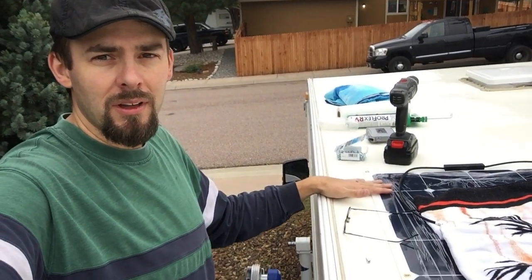Now that it's finally not raining — it's been raining for days — I finally decided to put the solar panels on the roof. I've cleaned the roof extensively: soaked it down, cleaned it off, used some mineral spirits to clean it up really well, then rinsed that off and soaked it down one more time. I've already got one panel up here covered with a towel so it doesn't generate any electricity, because I've got to splice the wires together. I've got two of these to go on the roof and may add a third. They're nice and lightweight — they're the flexible solar panels. They've got a really thick plastic backing so they're not super flexible, but they seem resilient. I'm hoping to get a 400-watt system — maybe 300 on the roof and 100 watts of portable.